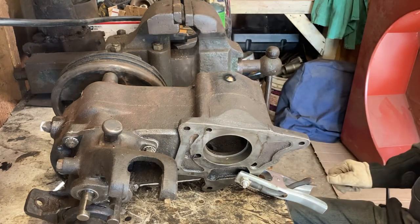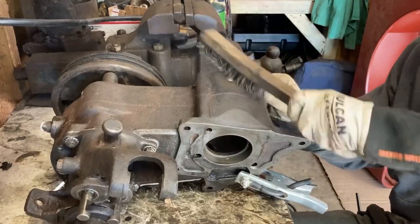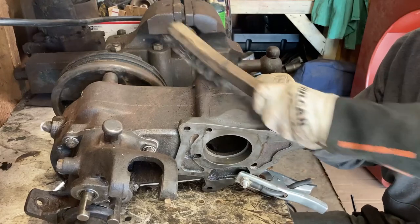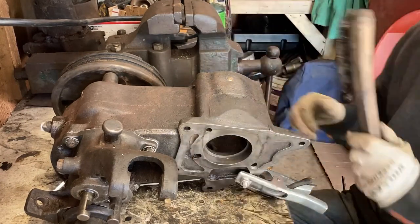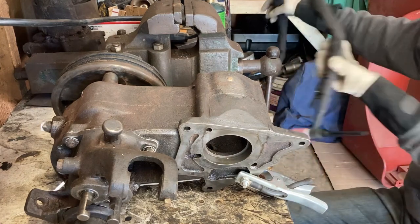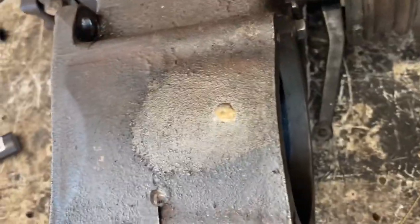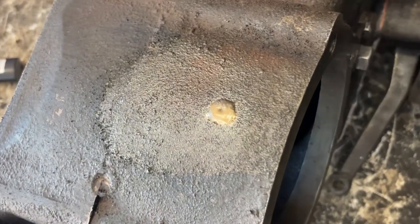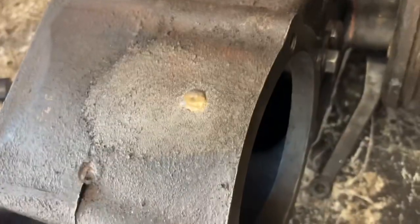Well, that was rather uneventful. Great success! It's got good penetration — I can see it starting to poke through. There you have it: there's a little dimple in the middle. I tried to kind of back off the pedal and fan it out as I was stopping. I think I could have put more filler in and it's probably sinking down through the hole, but I would say that did the job. You can see it has that bronze color.